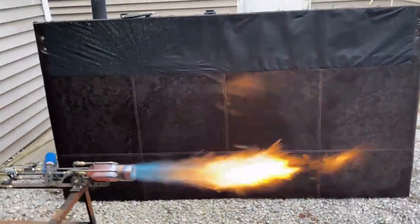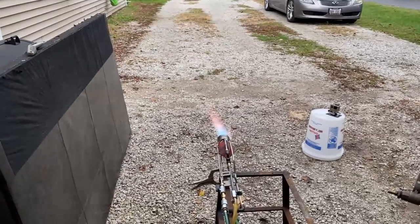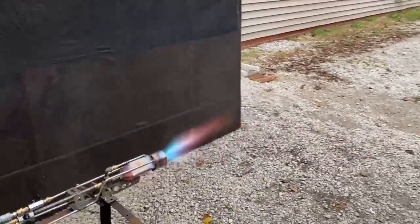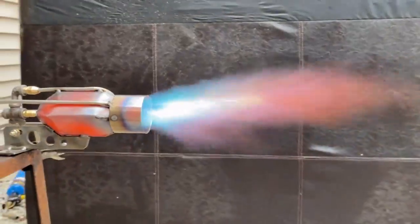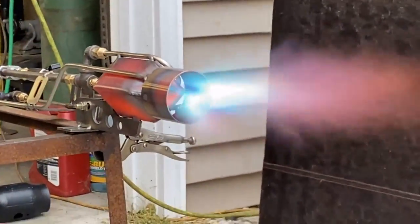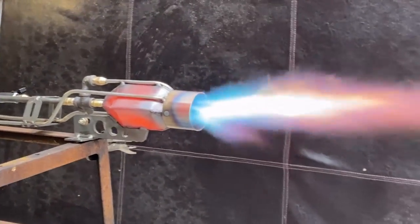The strategy we're going to deploy is: this burner will be stuck inside a foundry furnace heated up to a temperature of 2,650 degrees, because that's about the maximum you can get with a standard foundry setup. And once we hit that temperature, we will then add oxygen for that last minute or two in the foundry burner process to then melt the camshafts, the nickel, stainless steel, or whatever high-temp alloy we're attempting to melt.